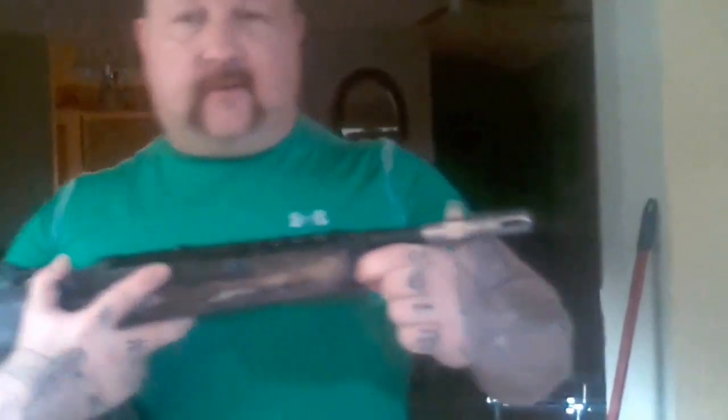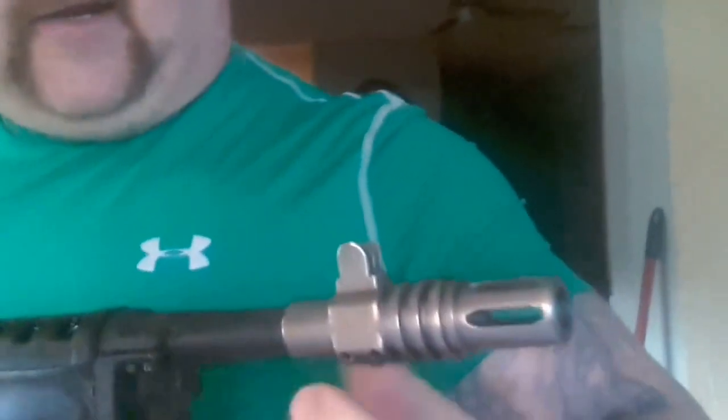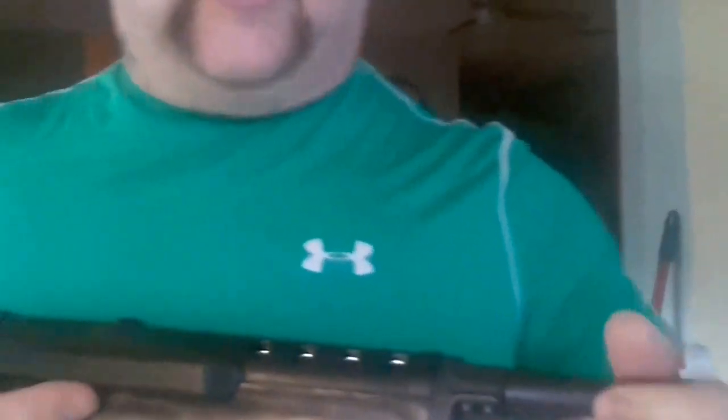On all the earlier prior 580 models, I think 183s, 189s, back in the day, they were skinny barrels. And because of the skinniness, you had a lot of fluctuation, and sometimes the barrel would whip. A lot of people sell aftermarket parts, a piece of metal or a flange that goes underneath and clamps onto the barrel, to try to minimize that.